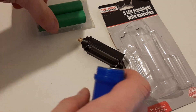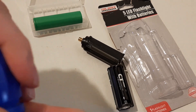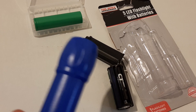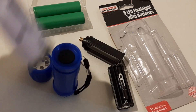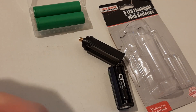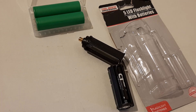Apparently I just had the polarity mixed up. So let's try the Murata again — this should be entertaining. Negative side up for some reason. I am worried because I think it's half an amp apiece on these, and this can do 33 amps. So if there's no limiter, we're about to light this thing on fire. Okay, Panasonic CGRs — almost as nice. Positive side down, apparently. What is going on? Does this just not work at 4.2 volts? That's really strange.